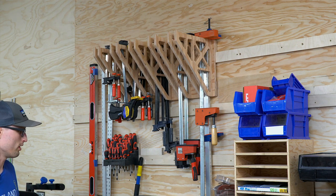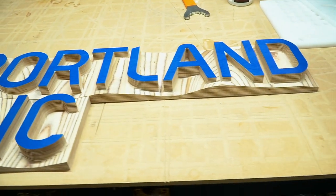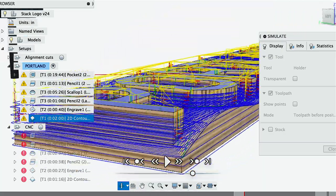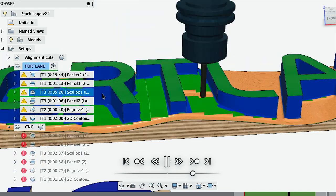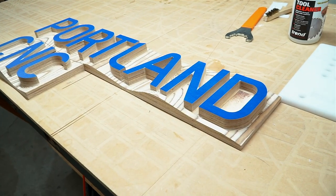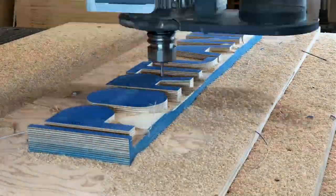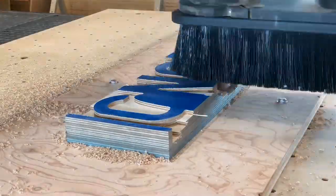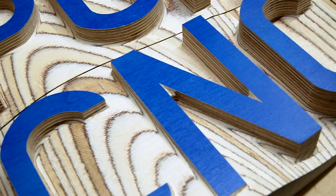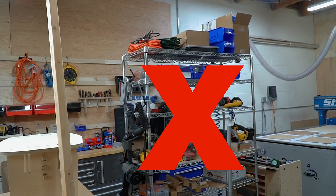We had a little shop warming party and made a sign for the occasion. It's a fun experiment combining a 3D surface with 2D graphics — about half an hour of design and an hour of figuring out how to make it. It turned out really well; we were finishing it up as people were arriving. It's just spray paint on apple ply with the surface removed, using scallop milling from Fusion for some nice texturing. We used a quarter-inch down-cut, a quarter-inch ball mill, and cleaned up corners with a 60-degree engraving bit for sharp edges visible at a distance.